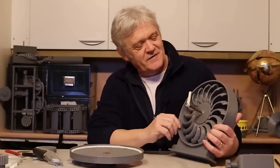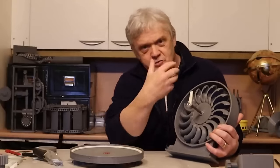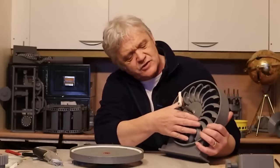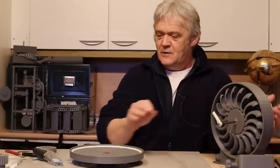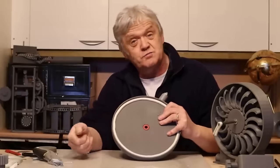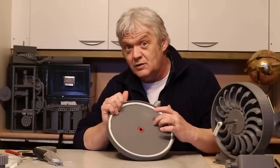For me that was a learning experience. The housing bit worked really well - the water didn't clog up and drained out nicely. But I'm more uncertain about the nozzle section - I put in three holes that are 2mm diameter and I don't think the water came out with a lot of force, particularly compared to just putting my thumb on the end of the pipe. So I'm thinking these holes aren't a good idea - we could look at maybe a slot and take it down to 1mm. I hope you enjoyed the video - I'm going to pursue this further because I certainly think it's interesting.